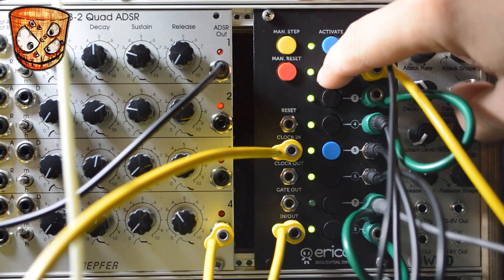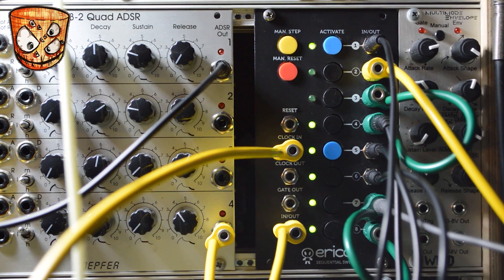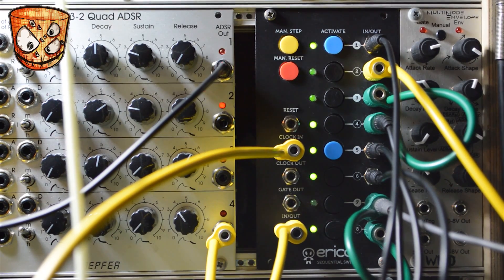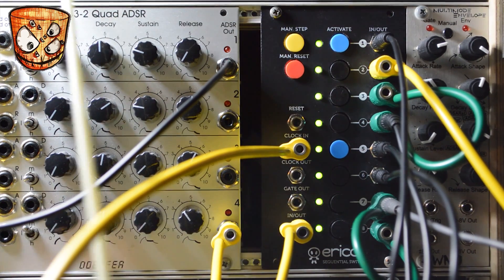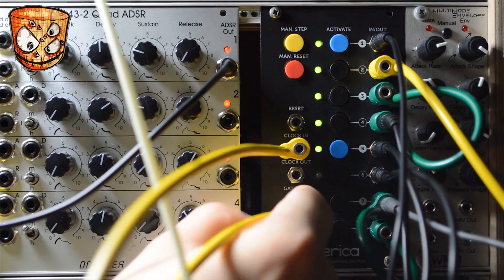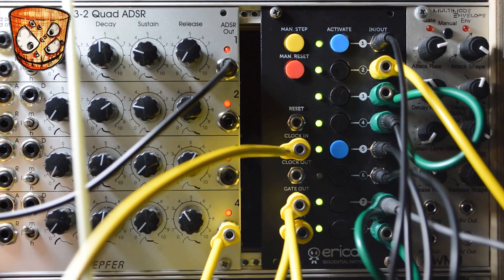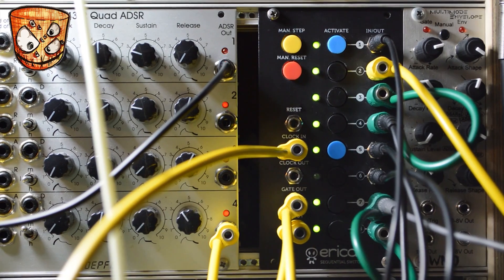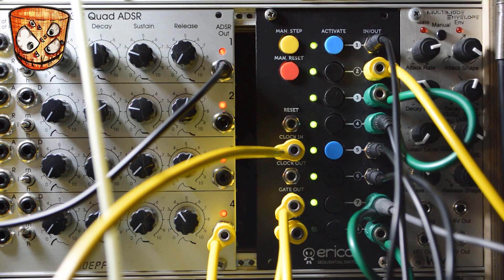We can double press the step buttons and skip a step entirely. Pressing the step once will mean the clock actually goes to that step but there's no output present. The unique feature is the gate that's generated by the switch. I'll use the gate output to trigger the bottom envelope which is going to control the level of the switch output on a VCA which is then going to the filter. So we've got clocks passing through to this VCA and we're actually modulating the depth of the triggers by triggering an envelope with the gate output from the switch — giving a fading trigger effect.